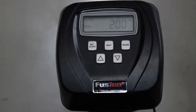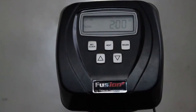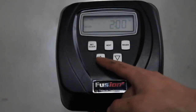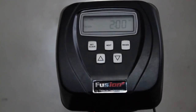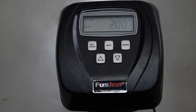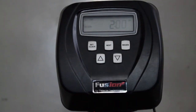Finally you will be able to adjust the regeneration time. The screen will say 'Set Time Regen' and the first number will be flashing — this is the time that your unit will be regenerating, backwashing and drying salt. The first value sets the hours, so press Up or Down to get to the appropriate time. We want to leave it at 2 in the morning, so hit Next again. This will adjust the minutes — we want to leave it at 2 in the morning, so press Next and the settings will be saved.